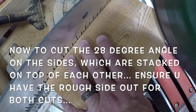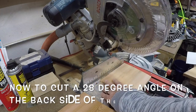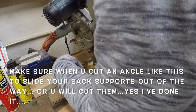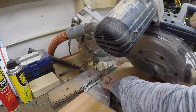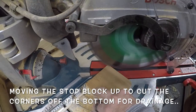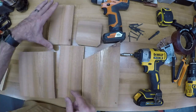Back at the chop saw, we'll cut the angle on the roof — the slope is 28 degrees. Cut the top support to four inches, then cut the 28-degree angle on the roof. Make sure you move your back support so you don't cut off the corner. This allows the back of the roof to slope with the back. Finally, use the stop block to cut off the corners of the four-by-four floor for drainage.